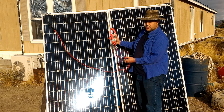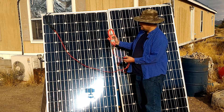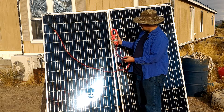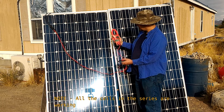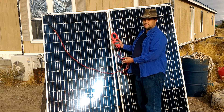We got 43.231 volts. It's bouncing around — the sun's dimming it again. But we're up in the 40s, over 40 volts. This is good. This is telling me that all of these cells connected up in this panel are producing electricity. I've got no shorts — real good.